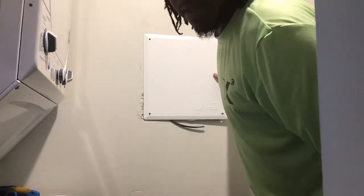If something didn't work in a pre-wired setup, you basically have to call in, tell them they need an electrician, and they can run new wires. The junction box has four screws — you want to find it. If the customer doesn't know where it is, you've got to look for it. The main feed might be downstairs in the garage, basement area, a hallway, stairwell, or even outside somewhere.